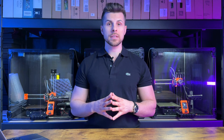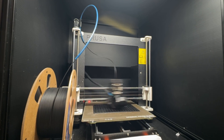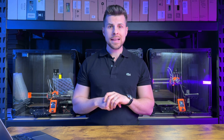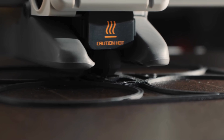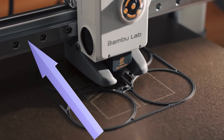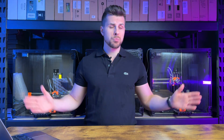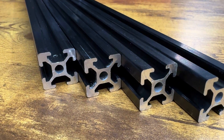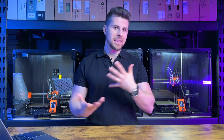If you want to build your own, I made a list of materials. This particular 500mm cube version can fit perfectly a Prusa Mini or an MK3S. I'll put the plans on my website for free — link below. If you have another Cartesian printer you want to enclose, check the overall bed travel and Z travel. Speaking of cost, the bill of materials is pretty short. You will need 12 500mm aluminum extrusions that will cost you around 40 to 50 bucks, depending where you shop.